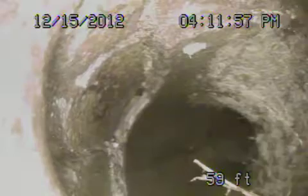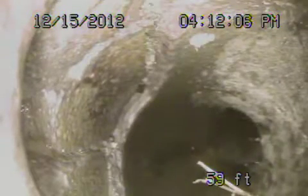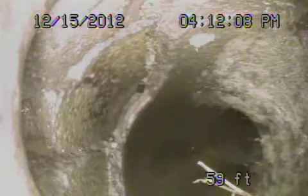As soon as we come off here, this is going to transition to a four inch pipe. You can see the break — see how it's broken here? This is going to be four inch clay. You can see it's cracked and broken there. That's the bottom of the pipe, so water is soaking into the ground there. Eventually it could cause a cavity and then the pipe is going to break completely.